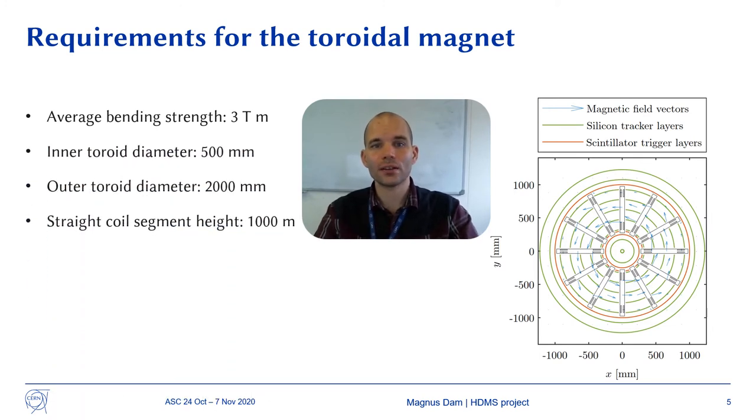The shape of the magnet is chosen to be a toroid, mainly because a toroidal magnet has a total magnetic moment that is zero. A zero magnetic moment is necessary to avoid unwanted rotations or drifting when the magnet is placed in space and affected by the interplanetary magnetic fields. With an ideally zero total magnetic moment, the orientation of the magnet can be adjusted with magnetic torquers.